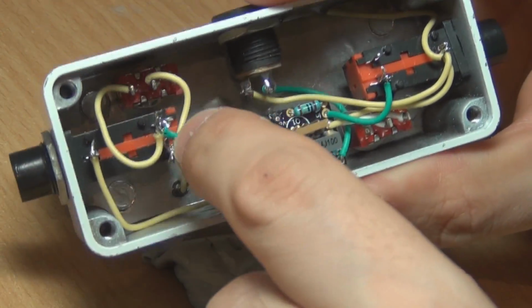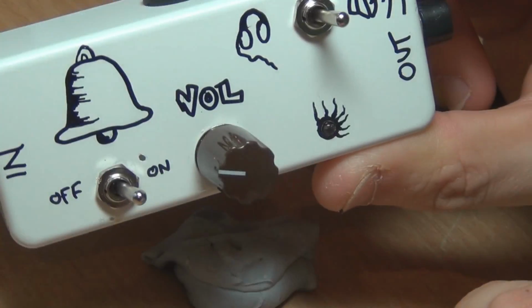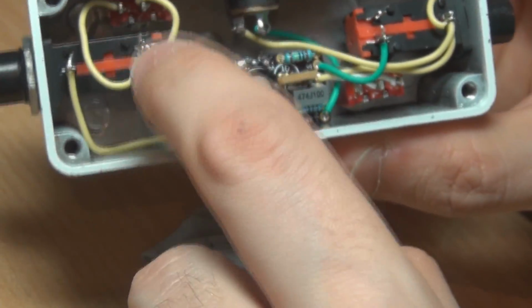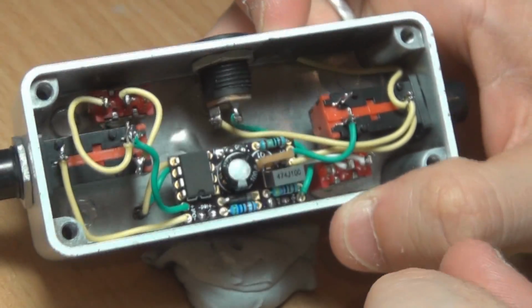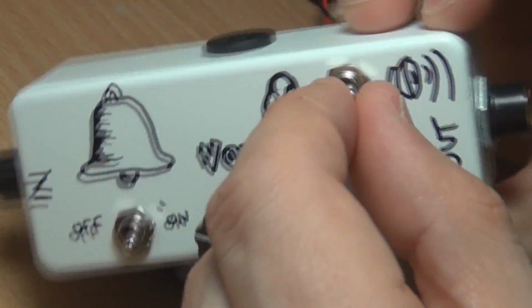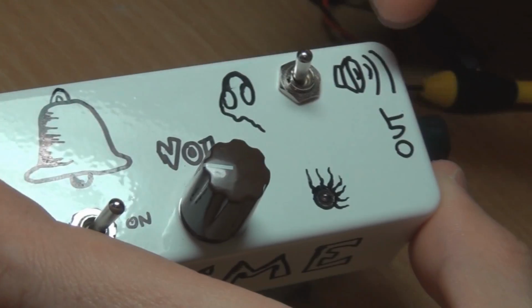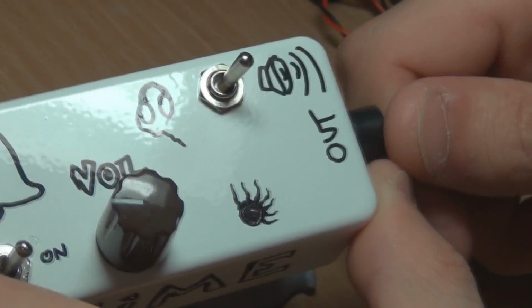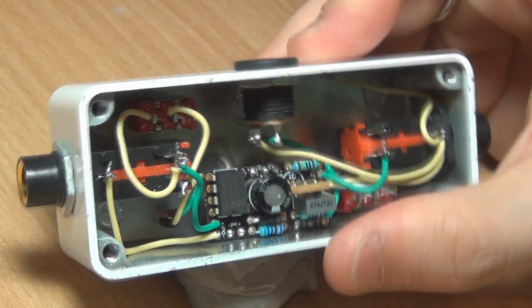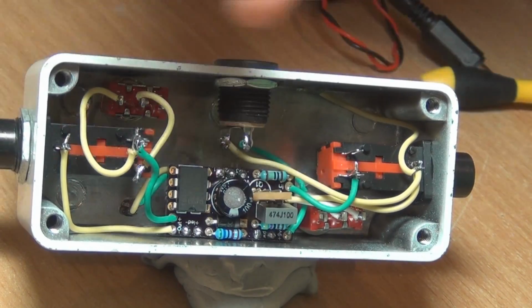And this switch wiring isn't a very elegant solution, because I can actually short out the output. If I've got this on headphone setting and I plug a speaker in, the output will be shorted. It just happens to be the way that it's wired up, because your headphones are stereo as well, so that's why that jack's there. I think it shorts ring and tip together when it's on headphones, but your speaker cable is mono. So when you plug that in, you're going to short plus and minus together, if that makes sense. It's hard to explain, but when you get to the point of actually wiring that up, you'll probably see what I'm talking about. So you're either going to have to use 2 separate jacks or do this switch thing.